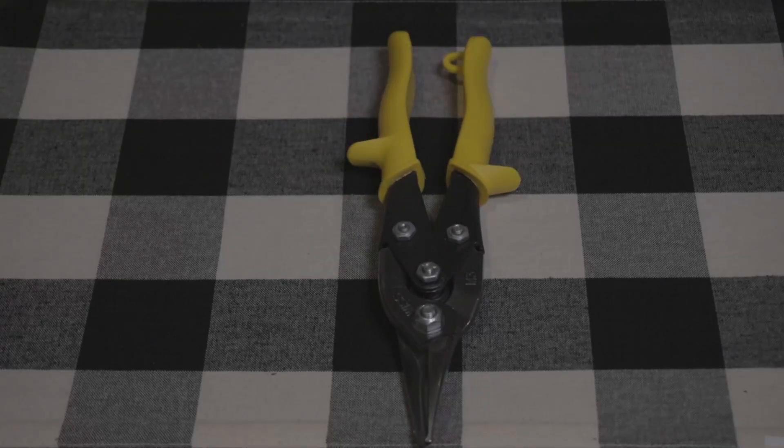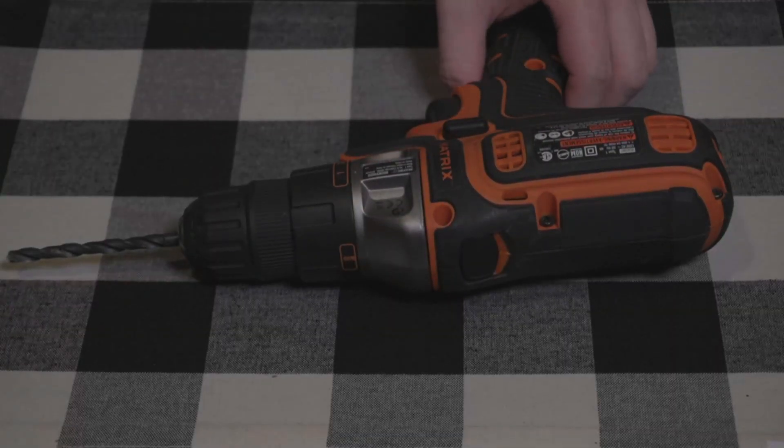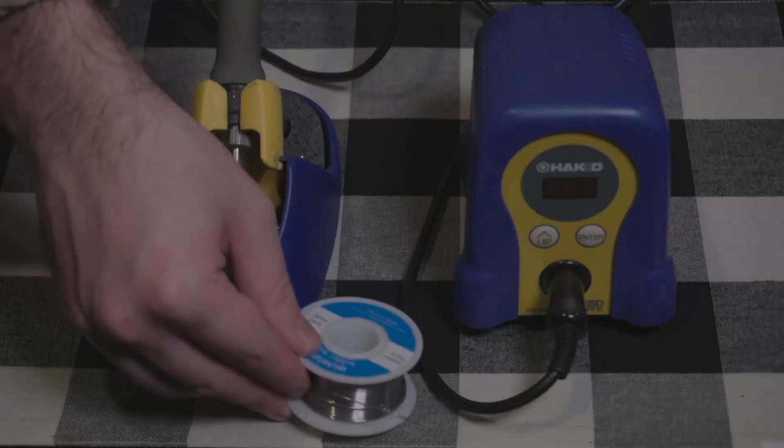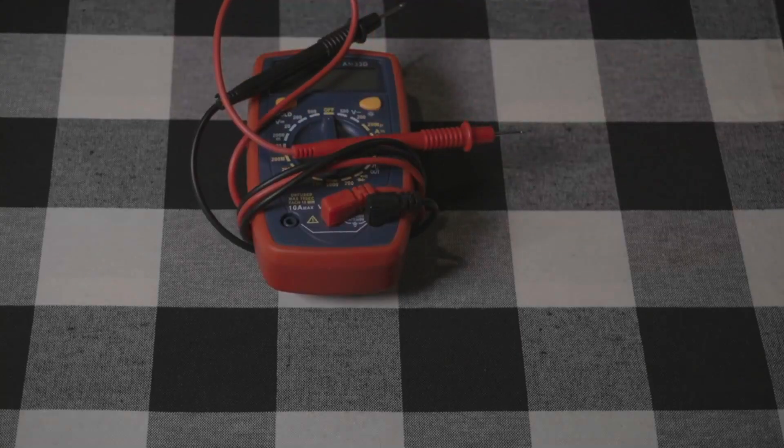In terms of tools, you'll need eight things: tin shears for cutting the copper strip board; a drill with a nice wide bit for cutting traces on the strip board; a soldering iron plus solder; a fine tip Sharpie marker for marking off the board; a 3D printer if you want to make the cases; a file or sandpaper to smooth out rough spots; basic hand tools like flush cutters, wire strippers, and needle nose pliers; and a basic multimeter with a continuity test mode.